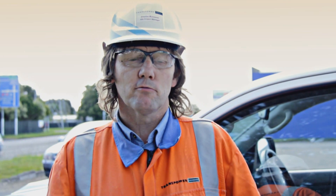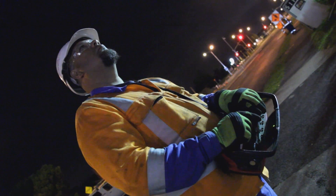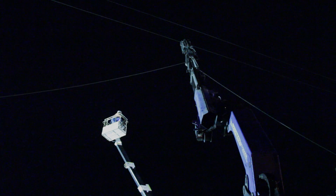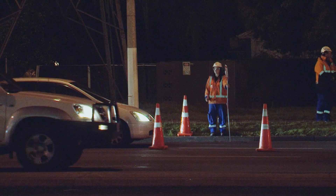About a week before, we'd come through and remove the conductors from the spans either side, so we had the conductors tied off on the tower legs. We then had a winch which lowered the conductor. Once we were in a position to lower it completely, we would contact the traffic management people who would then stop the traffic at all four intersections.